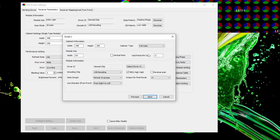Now you have some settings to adjust. The first is your cabinet information — the width and height. This is how many total pixels are on the panel, not how many panels wide or tall, but total pixels. I have seven panels across and they are P5 panels, which means there are 64 pixels within each panel. So seven times 64 gives a width of 448 pixels. There are 32 pixels vertically in each panel and eight panels up and down, so eight times 32 gives 256. The cabinet type is the way the color works on your panels — most panels are full color, and if you don't know which type you have, just leave it at full color.